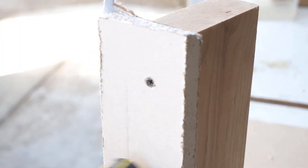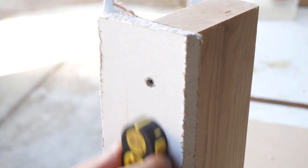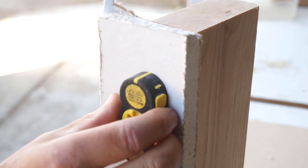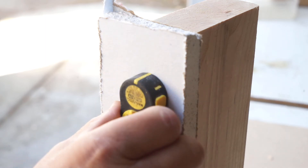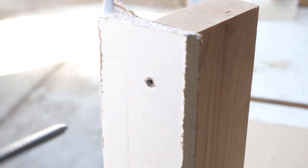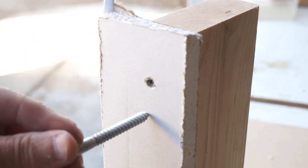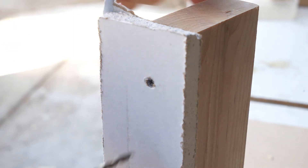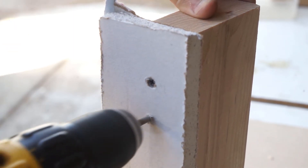This is a cutaway of drywall, sheetrock, and a 2x4, along with a magnetic stud finder so you can find the studs. What the magnetic stud finder does is it finds the drywall screw heads that are usually under mud or joint compound. Then you can determine where your studs are. Once you find one, the studs are 16 inches apart so you can find the rest of them.